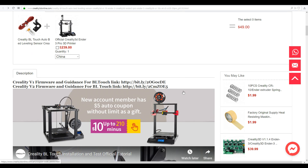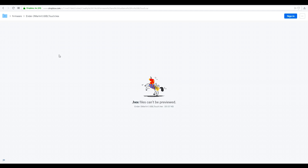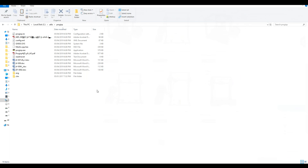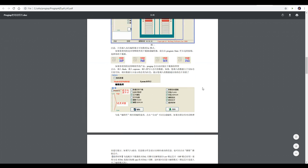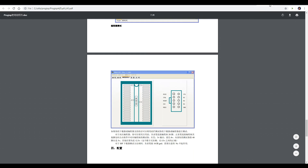If you go to the shop page for this product there'll be two links, and for an Ender 3 we want the Creality V1 firmware link. Once you click that it'll take you to a Dropbox where there's a pre-compiled hex file to flash as well as the software you'll need. Unfortunately I couldn't get anything to download — I'm not sure what the problem was. Fortunately on the download page on the main website there are the required files. You'll notice all of the documentation is not in English, and because this is a cloned programmer it's not compatible with the usual AVR Dude software, so we're stuck using ProGISP.